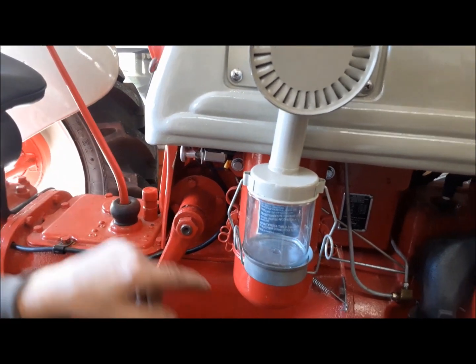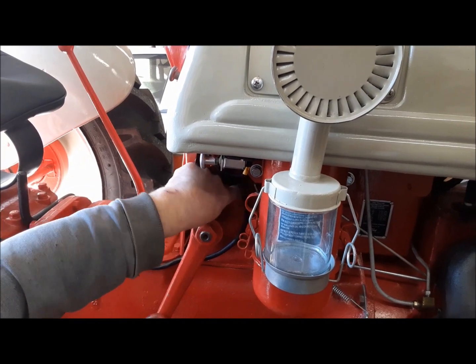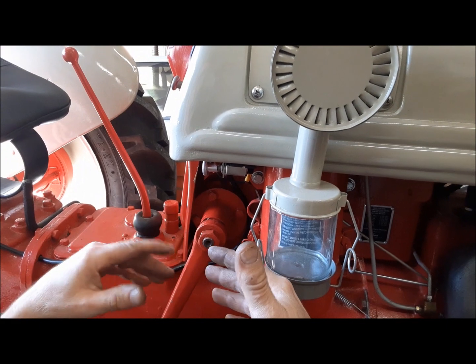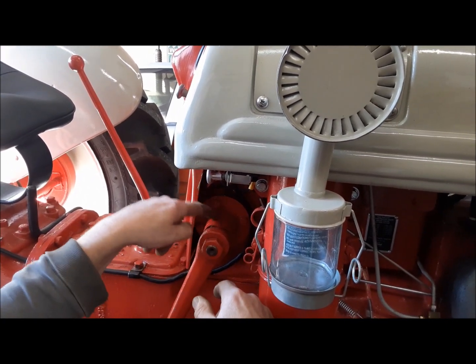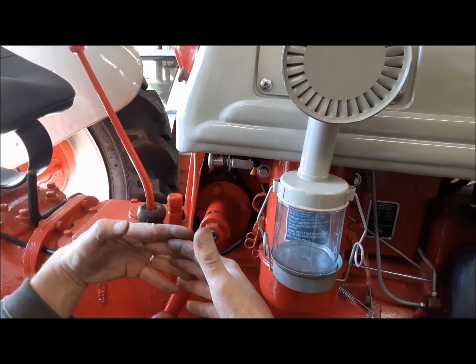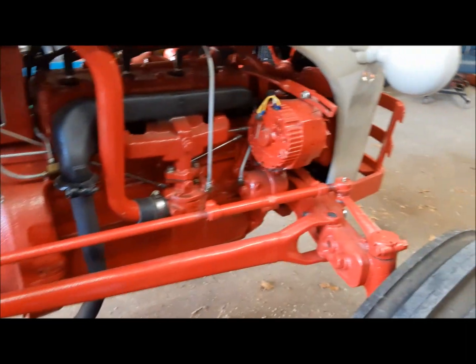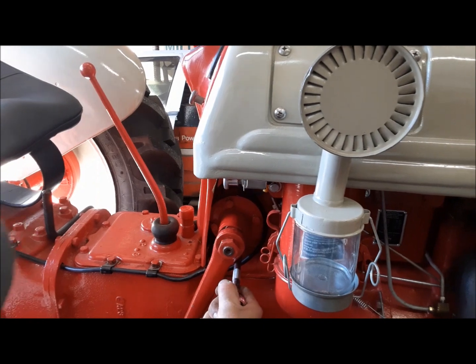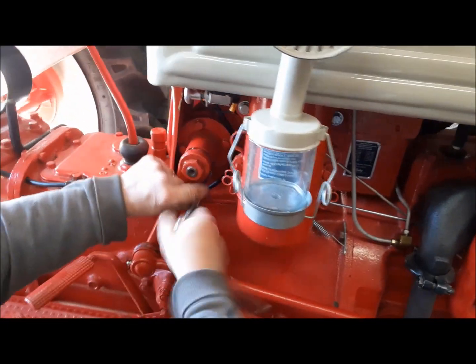The left sector is a little bit further forward, and it's got a gear on it that runs on the gear on the ball nut on the steering shaft, and then it's double-sided, right? It's also got a gear on the back of it that engages with the gear on this sector. And so if they're loose like this one is, it's gonna let this wheel flop around. So we are going to attempt to tighten this up. And I got a bad feeling that a whole bunch of oil is going to come out of here, but we can clean it up and put more oil in it.